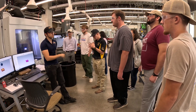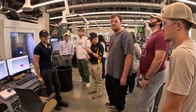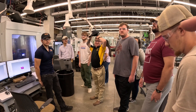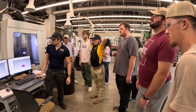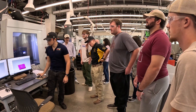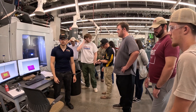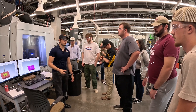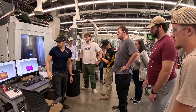The key word is it should work, but there's a lot of things that go wrong. That's why you put your finger on that red button — anticipate it's going to crash, and turn it on slow. Turn that rapid feed override down to 5%, especially at the beginning. It's a real good way, especially with the verify, to see if you accidentally set a depth wrong or left some stock, or your depth is too high or too low.